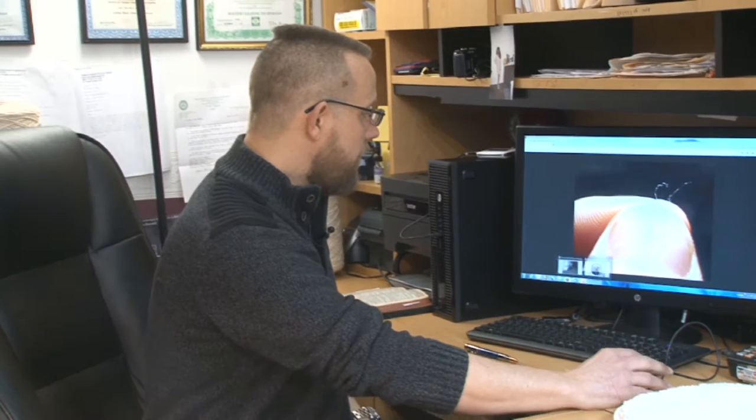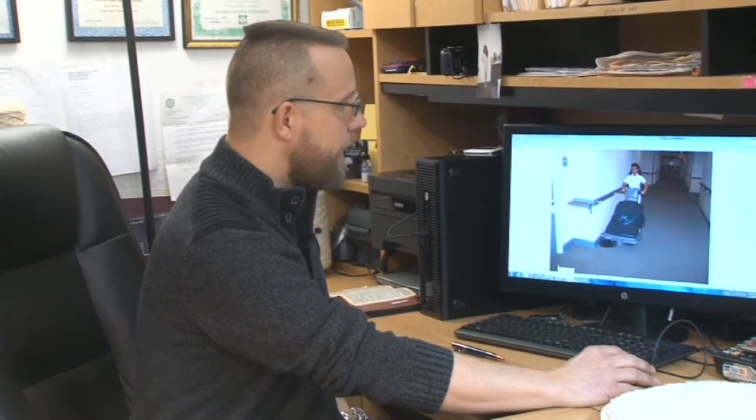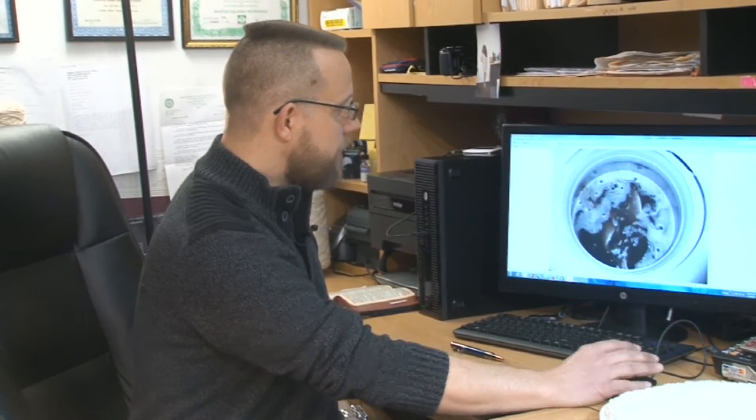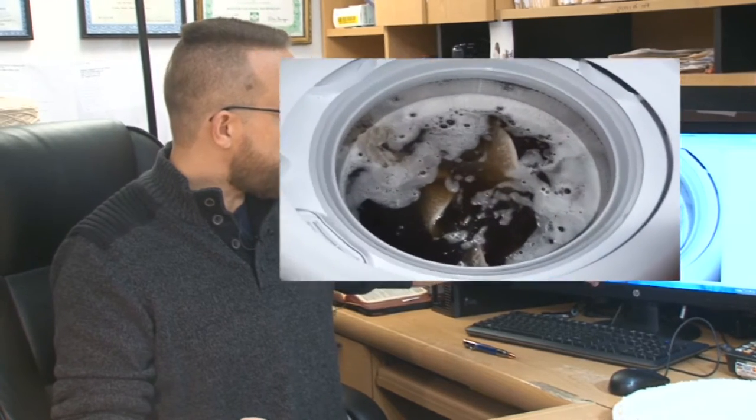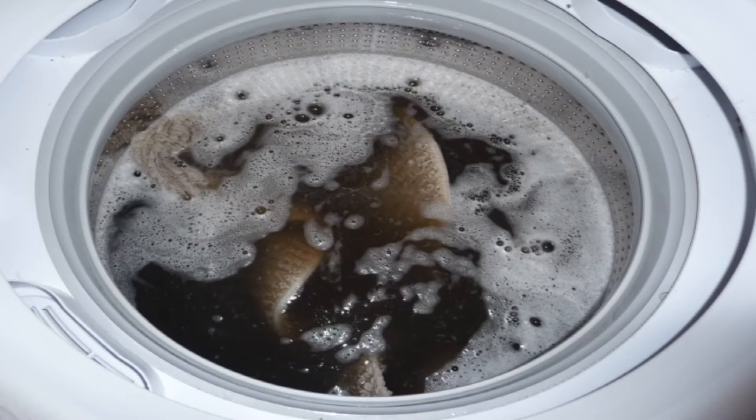Now if we look, your pre-vacuuming is going to help greatly with that, but also if you're doing a commercial job, say monthly, so you're going to clean that 12 times a year, you can either flush soil at the bottom of the carpet 12 times a year, or every time you take out your bonnets from that job and you wash it, you can see just how much soil you're removing before the end cap takes over. So again, this is very important. You could do dozens of bonnet cleanings every year, and all those dozens or hundreds of gallons of dirty water you removed is no longer in the customer's carpet.